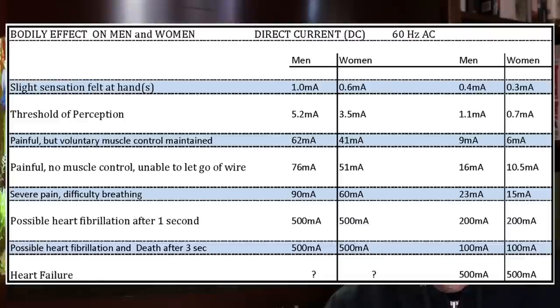I'm going to show a quick chart that shows the effects that various DC and AC current levels can have on the body. The effect of an electric current passing through the human body is determined by how much current is flowing and the length of time it flows. This can be worsened by things like holding metal aquascaping tools, having your hand or arm in your aquarium, or standing on a wet floor in a puddle. The worst case is when body contact causes the current path to flow through the heart. The good news is that to prevent this, the National Electric Code calls for the use of Ground Fault Circuit Interrupter devices, or GFCI — sometimes just called GFI. There is something you can do to protect yourself and your family, which I'll explain in detail in upcoming episodes.